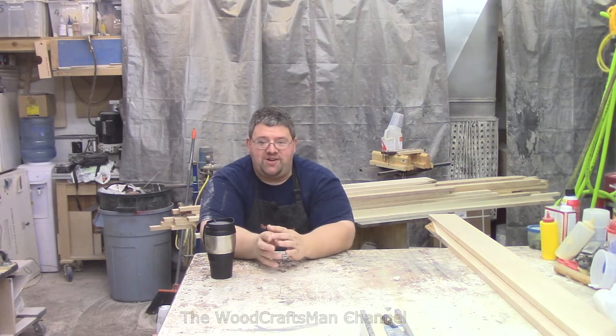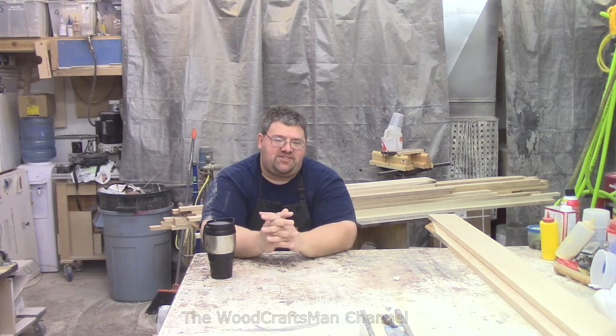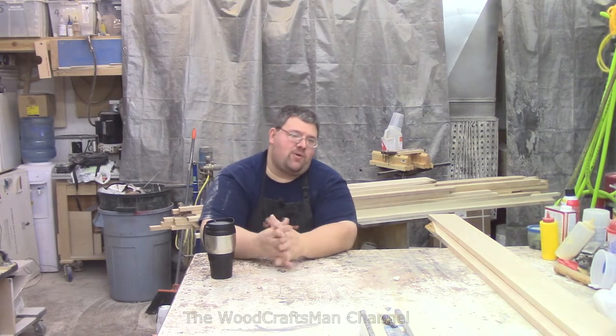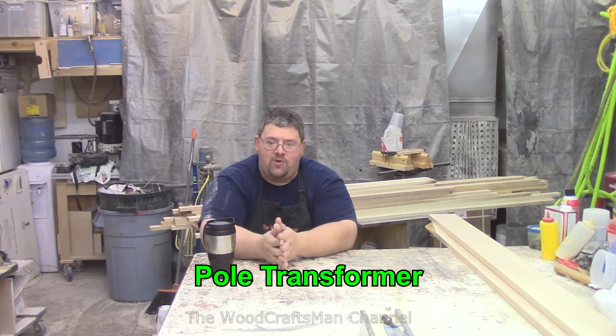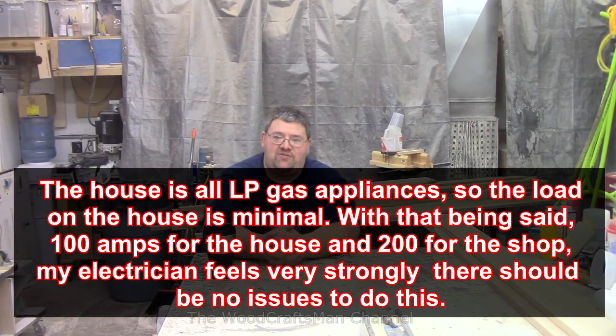Plus, he also told me, you may never use more than 100 amps, but at the same time, if you ever wanted to add a rotary phase converter, now you have the power to do it. And he said he was going to check into the other things, making sure that the pole was big enough and that the power company ran heavy enough wire from the pole to the meter. If not, we have to work that out, but he was going to check it out sometime in the next month or so and let me know what else needs to be done.